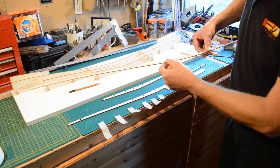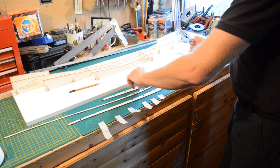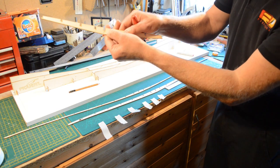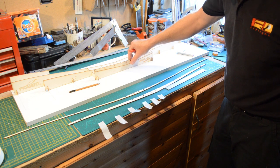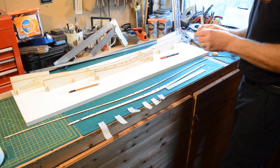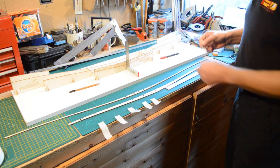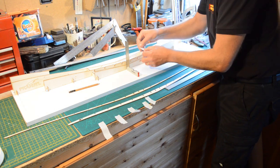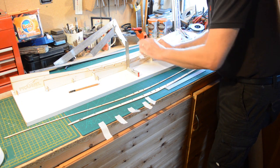Remember to get all the notches facing the same way. I'll start with the front which is the smallest bar. What I've done is mark a center line down every one — not that you really need it, but just as an aide-mémoire to make sure you don't forget. With the set square I'm going to push that up to there, and then between the notches I'm going to use masking tape and get that square on the end as well.